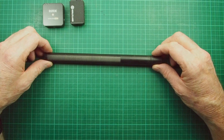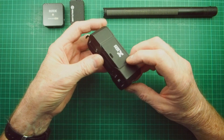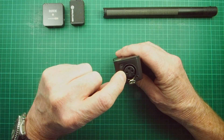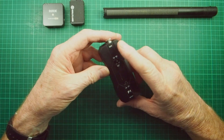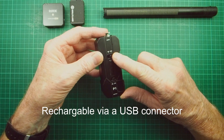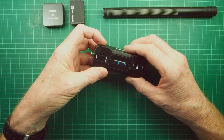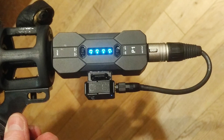There is a solution I found online called an XVive P1. On paper it sounds fantastic - it's a small metal box with really good build quality. It's got an input XLR and an output XLR, and in between there's a battery inside that transforms up to 12 volts and 48 volts. So you simply switch it on, get 48 volts of phantom power going into the microphone and audio coming out downstream. On paper it sounds fantastic.